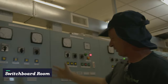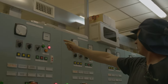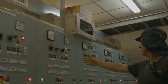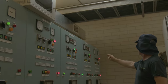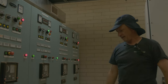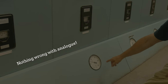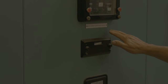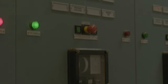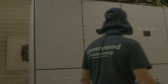They have two fairly decent sized air conditioners servicing this switchboard area. You're talking about the main high voltage circuit breakers in this area — irrigation pump unit number one, two, three, four, five and six. Down here you can see some old style analog dials — for instance here is an overcurrent earth fault relay. Pretty robust gear.